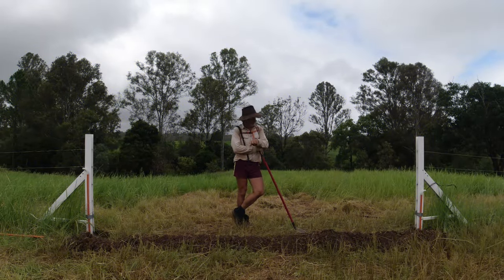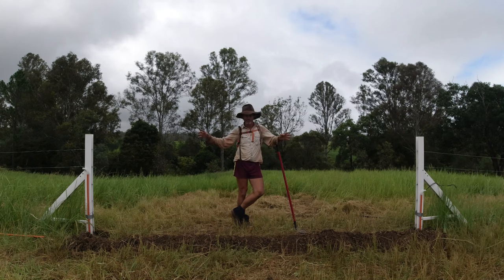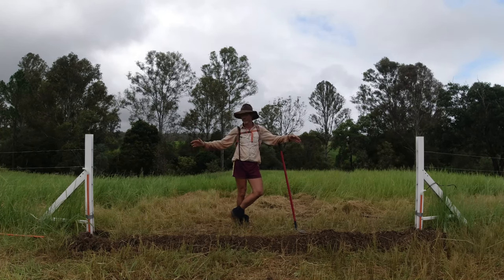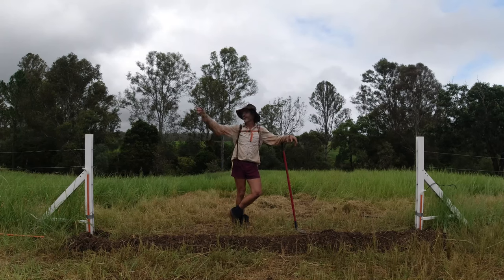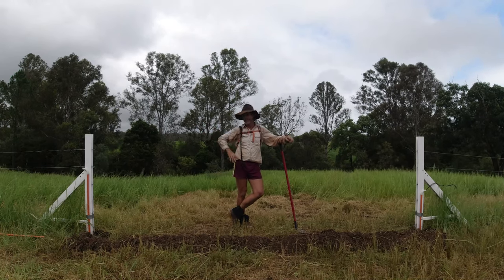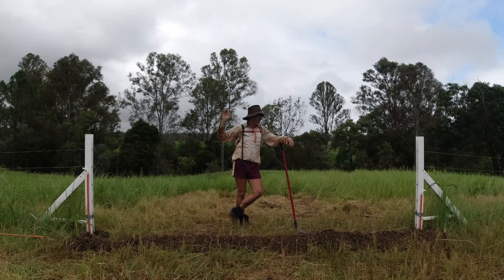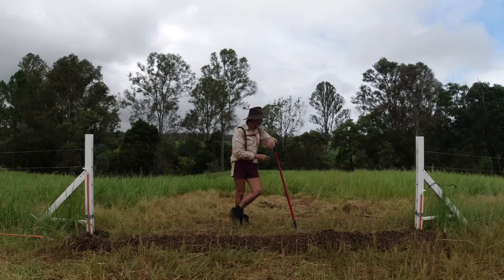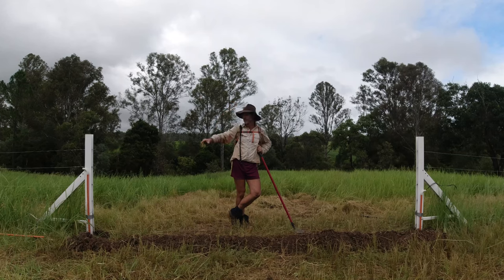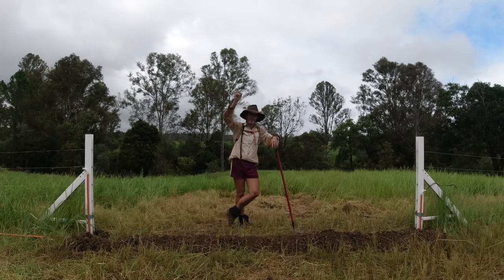The three reasons I've gone underground with this jumper cable: one, it looks a lot neater than going over the top — you can hide the cables underground amongst the H-posts without having that structure overhead. Two, if going over the top you'd need an additional structure, which to me looks untidy and also has to be maintained. Three, if I want to bring an excavator or truck through, I don't want them hitting a wire overhead — I want to keep this space clear for any future machinery work.